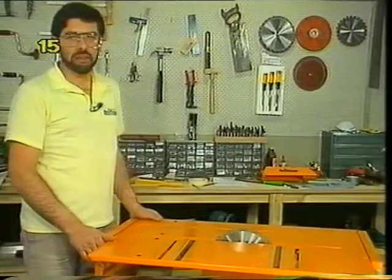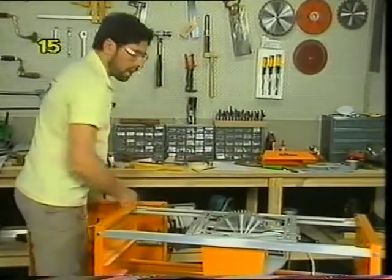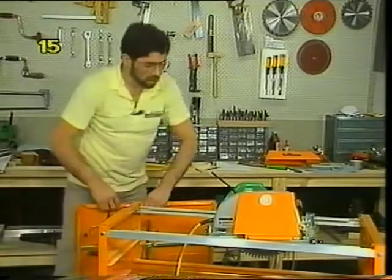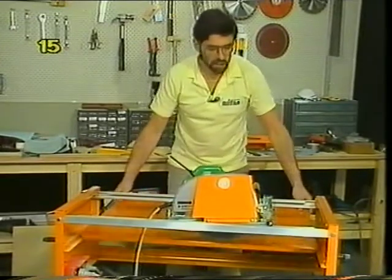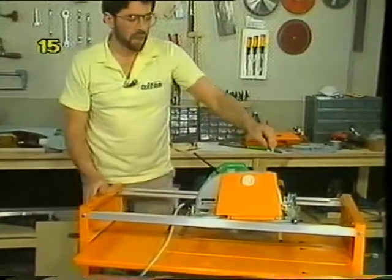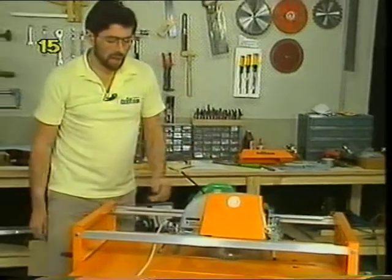When converting back from table saw mode to cross cut mode, clear off the table, remove it and put it to one side, then pull the saw towards yourself and flip it over — that way you don't tangle in the power cord. Rest those two bearings on top of the channels, turn the table around so the T-shaped holes are closest to the rear panel, slide the table into position and lock it in. Two important points: don't forget to put the bearings back in their channels — otherwise when you finish a cut you could drop down and damage your blade and Triton table. Also, the power cord must be properly rerouted; it can become snagged in the corner and potentially be recut by the spinning saw blade, so it's best to unplug and reroute the cord out beyond the front of the machine.